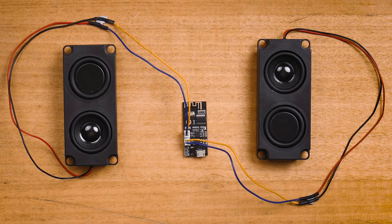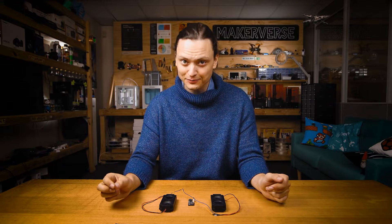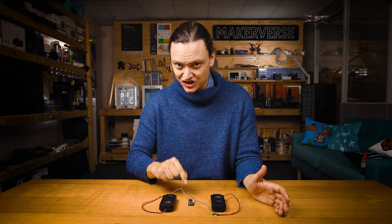It's a good time to note here: the output of the two power amplifiers cannot be connected in parallel, and the two negative poles cannot be connected together. If you were to do this, the module's onboard power amplifier chip is going to be damaged. If you only wanted a mono speaker, check the description — I have a Bluetooth receiver board down there which is perfect for you.